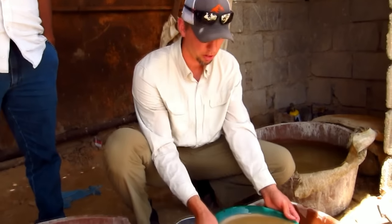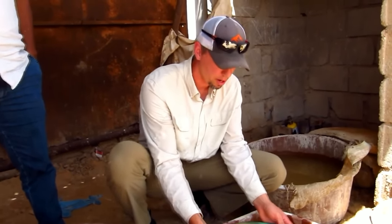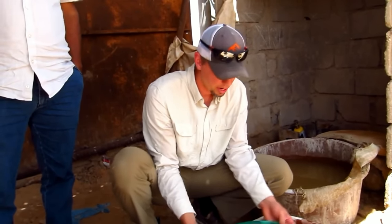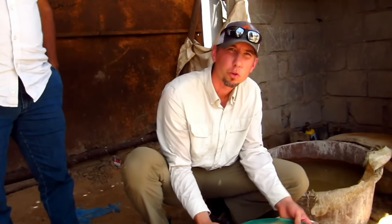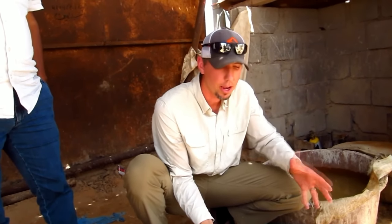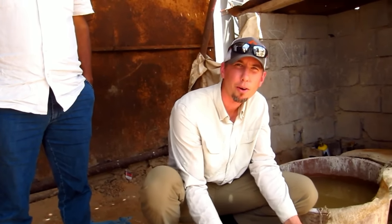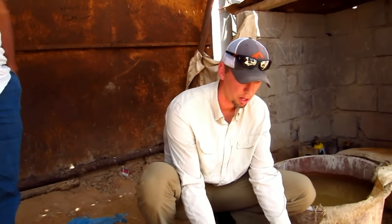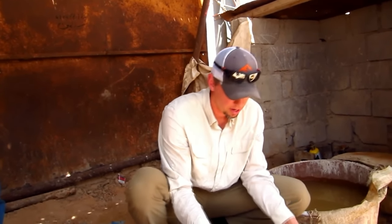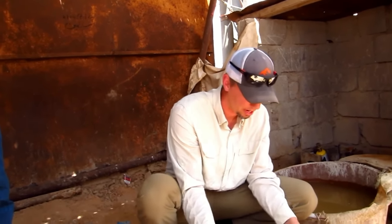What we're doing here is we've taken some tailings from the cone mills or the Chilean mills. And I'm testing to see if there's any gold or mercury left over. The way these cone mills work is the wheels go around, and anything that gets crushed in the water and flows out is tailings. After between 8 and 24 hours, they stop the mill and collect what's in the bottom. That's where the gold and the mercury should stay. But we'll pan and see if there's any mercury that gets out into the tailings.